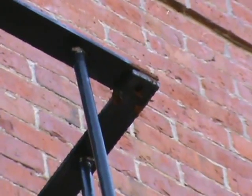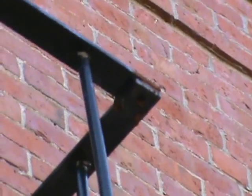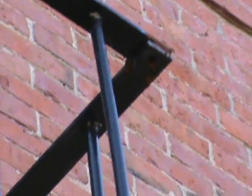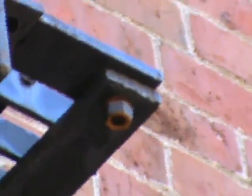You're going to see here, instead of changing bolts, a little bit of welding. See the welding right there on that corner, but then you see the welding is not proper up there. See how it's out of alignment and just looks like a tack weld happened up there. Same thing. Instead of changing the bolts, they just put some welds in there. Now these welds are exposed and they're showing signs of water intrusion and corrosion. So as soon as you put a bolt back in there and you seal those up, we don't have those concerns. It looks like they put a temporary bolt there. See that? But again, they didn't tighten it correctly.